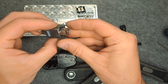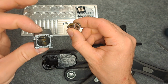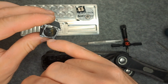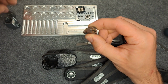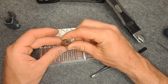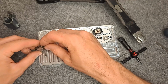And this is important for reassembly later. But first let's take out the core, and I will push on both sidebars to not lose them. You see the housing with the sidebar slot at the top, and here's a cutout for the rotation limiter. So let's put this manual away. And first of all, we'll drop the large sidebar and then also the small one.